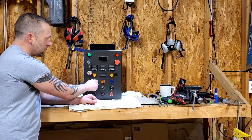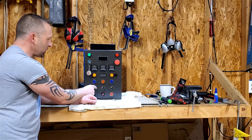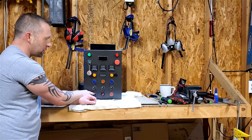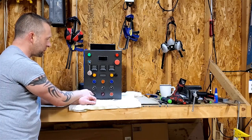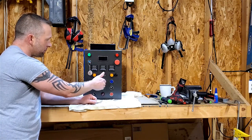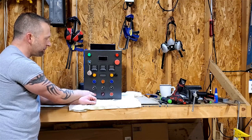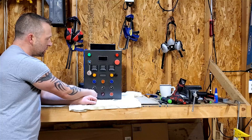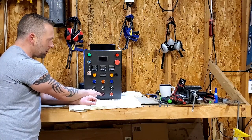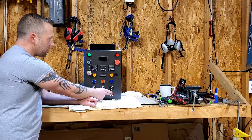LED, two-way switches for each pump. So again, I know they're on. And then these are all timer switches. Not critical, I'm not doing LEDs on all those, it just doesn't make sense. But same, in line too. So hot liquor tank alarm, mash tun alarm, boil kettle alarm, and then this is like the timer alarm. And then this is an alarm buzzer, so this will flash and then will also emit the buzzer tone. And then here's my stop reset button for my timer.